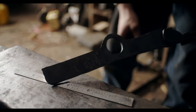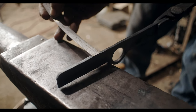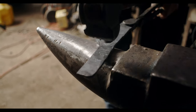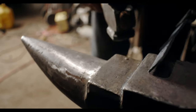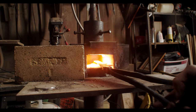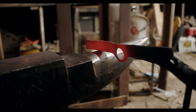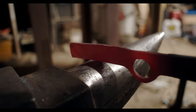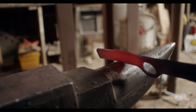It ain't going to get pried on or anything. You need a good thin edge — this blade is 5/32nds thick and I want it closer down to an eighth. I'm using the horn of the anvil right here to pull it out. You could use a straight peen or a cross peen, but I like to use the rounded side of my hammer and this horn to work it slowly and pull it out. As I do a pass I'll take an overhead look at my spine and make sure it's pretty consistent. Especially if you're beginning, it's really easy to forge in a really narrow spot, but with time you can get better at getting your draw consistent and working at the right heat.